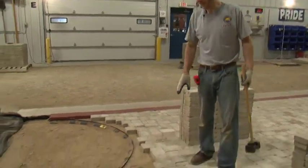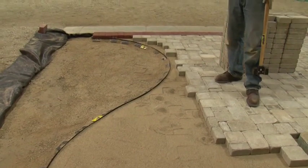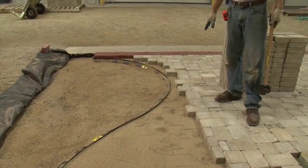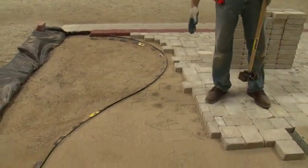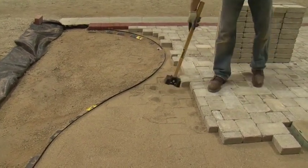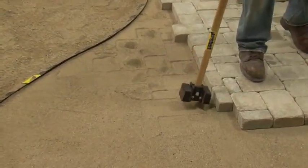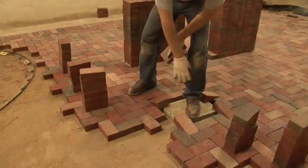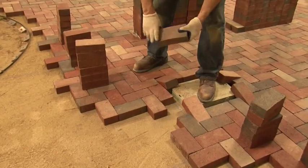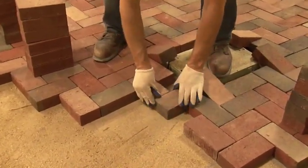In this example, we went a little bit too far — we brought our laying edge a little too far out beyond where we have a foundation behind us. So we pulled up the pavers where we went beyond and we're going to tap them just so they're snug right now. When laying your pavers around an obstacle, it's important to connect both laying faces as soon as possible. This lessens the chance that any bond lines are going to drift.